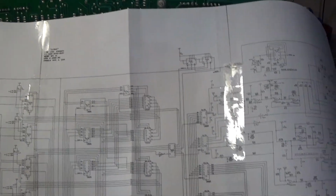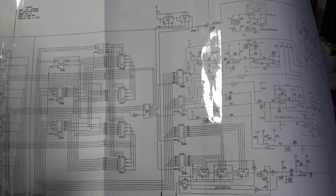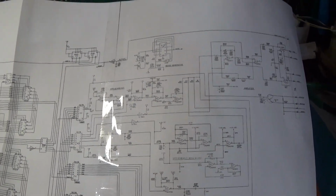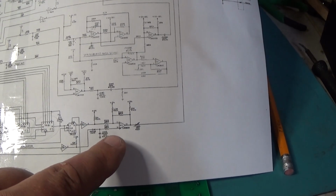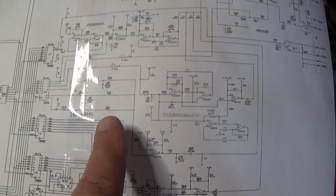I need to get the sounds all hooked up and everything. And I want to zoom in on these LM3900s. Are they using -5 volts? Because if those are using -5 volts, which I think they do, I think I'm just going to blanket replace every one of them, because one of them is drawing that -5 to where it shouldn't be. So I'm going to look at that really quick. Here's a 3900, 12. It looks like it's +12 only. Let me look at that off camera.